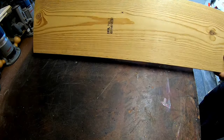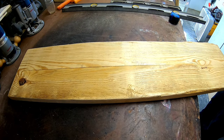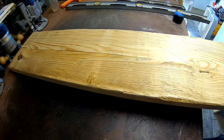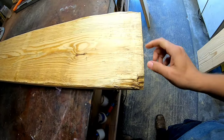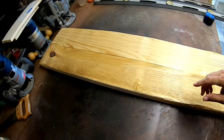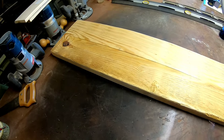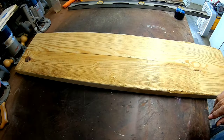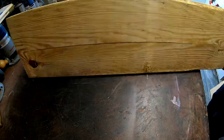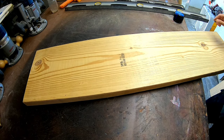First thing I do once I get my four-foot piece of 2x12 — I look at both sides. Down this edge we've got some damage, edges are bad, that knot there I think would end up being in the way right on the edge, and I don't want to take a chance of having a knot on the edge. So I'm going to make this the back side of the flag and this the front side — this is going to be the face of the flag.